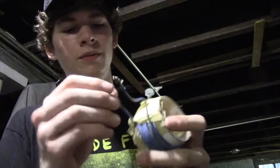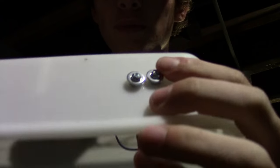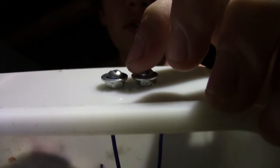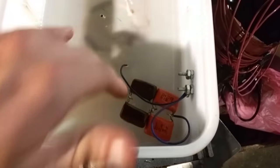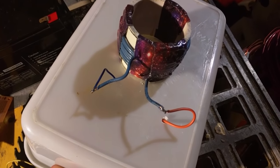The next thing you're going to want to build is called a spark gap — it's a gap that the spark can jump between. What I did for this project is I put two bolts in a box separated by little nuts, and the spark is going to jump right between those two washers. On the inside of the box I connected two wires. Then grab the old TV board once again and pull off a bunch of the big capacitors. They should be similar in color and look. We're going to make a little capacitor bank — solder about eight of them together in a chain, and that should suffice.